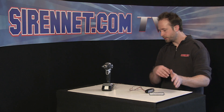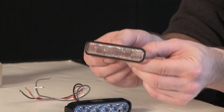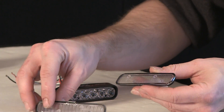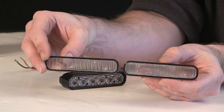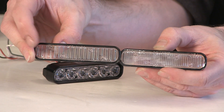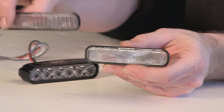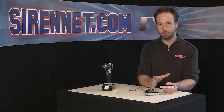And to show you, before I put the other one on — here is the wide angle: UV-resistant, polycarbonate. If we zoom in here, you can see between the two, the optics are definitely a bit different. Standard lens here, wide optic dispersion here, and you can see on this one the ribbing on the optics is a lot tighter than it is on the standard. So with that, the more ribbing it has, the wider the intensity or the LED manipulation spread is.